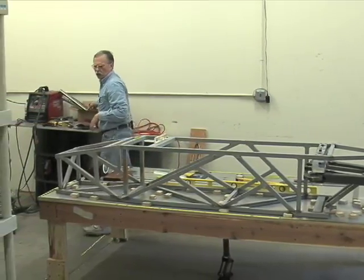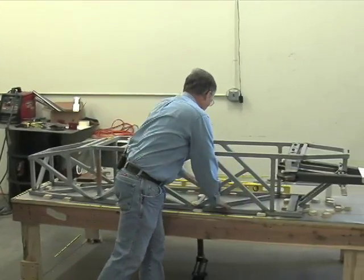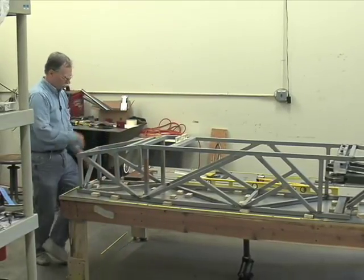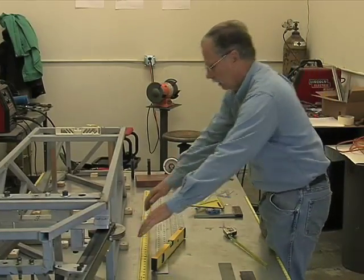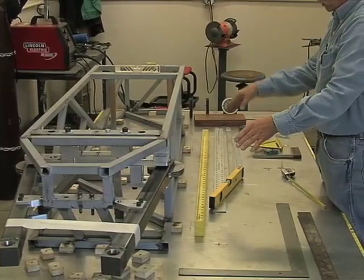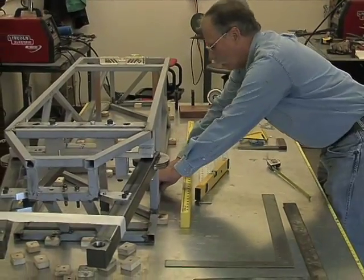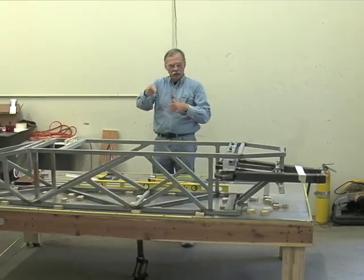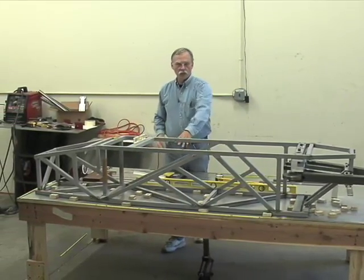So here's how you do that. You need something called stanchions on a jig. So here we can lay out the lower sections in X and Y. Take these wood blocks with screws, create our drawing on the table, make our little dots off our drawing, measure these lines, lay the metal down, and then move wooden blocks up next to them and screw them down through the aluminum cover sheet into the wood below, and that will hold these in firm alignment very firmly, so they will not move around as you're joining them. Even as the welding is cooling, it will hold them in alignment. So that's what a jig's all about.